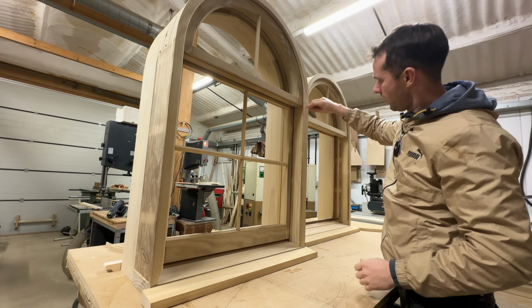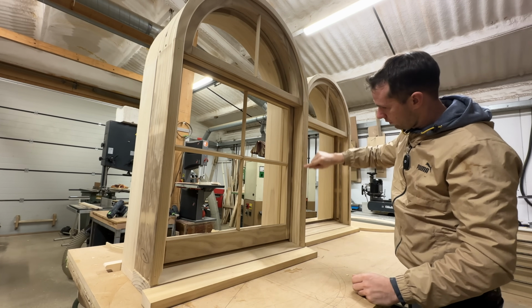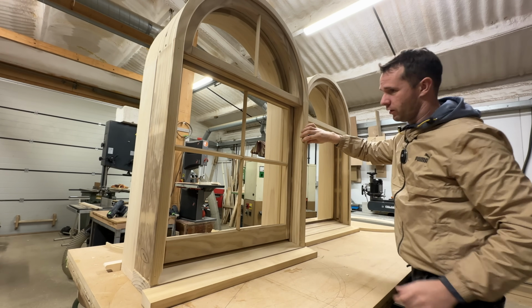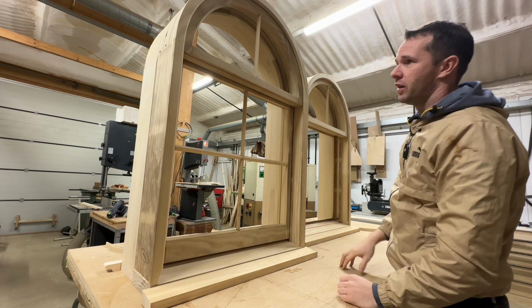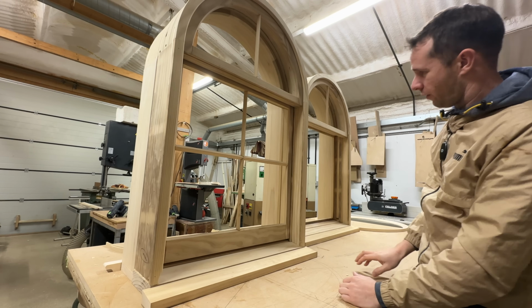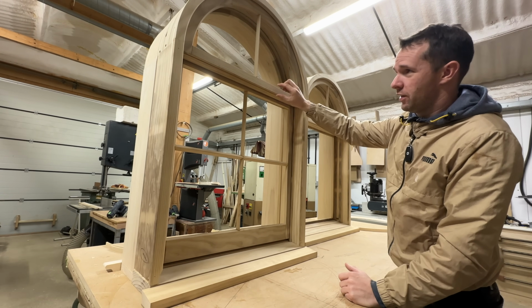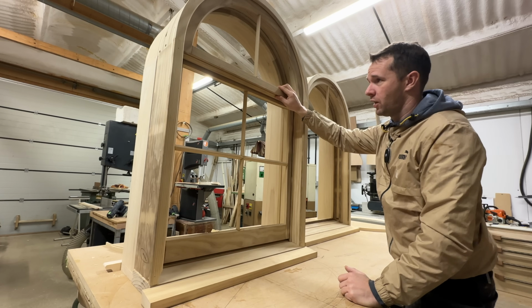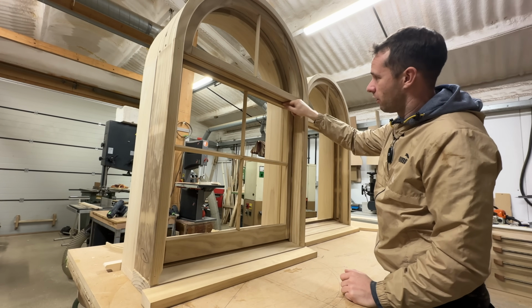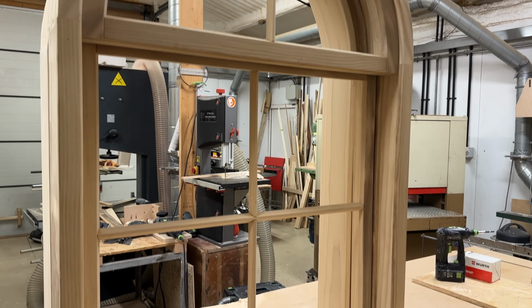But we've managed to keep, like the other sash window that I made after the video on, this outer section looks like the outer piece of a box sash window. So the actual outside external view of this looks as original as you're going to get for a mock sash window. Top sash rail is identical to a normal sash. Anything that's slightly different is the meeting rail drops a little bit there, but I don't think it really deters from the look of the window.